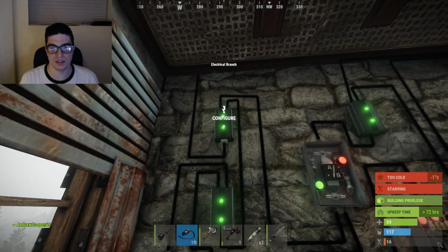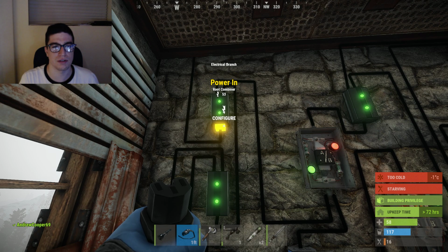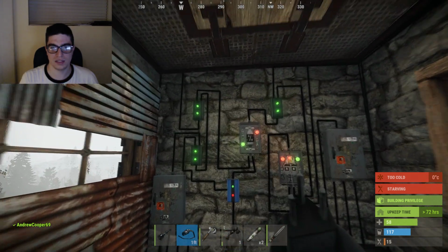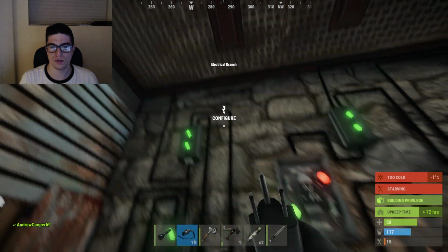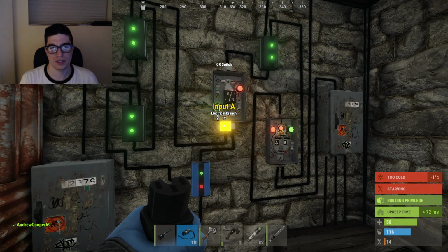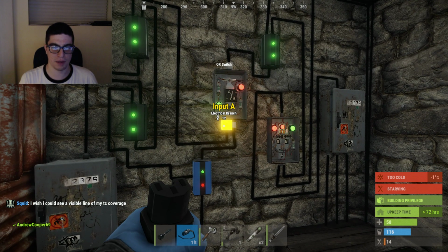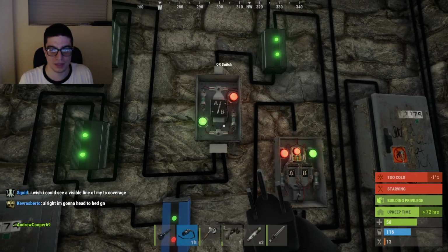So that's coming into this branch right here. It looks like there's 53 currently coming in from those 3 solar panels. So once those come in, the first branch right here, one goes into this OR switch. That's the first set of power, and that's to let the whole system know there's solar power coming in.